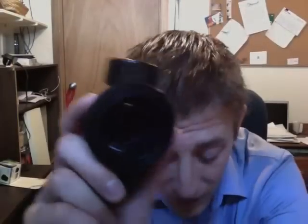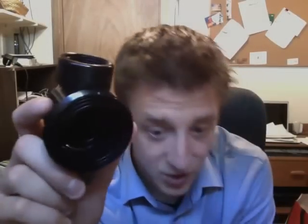So you got to be kind of careful with that. Again, you're looking inside the valve to make sure that there isn't any debris or anything like that. Often we'll find a rock, dirt, or even a pine needle that's giving you an issue. You won't find any rusted galvanized metal in your pipes because you don't have any. So that's not what you're going to find.